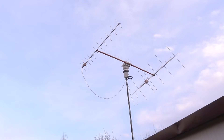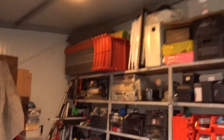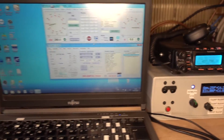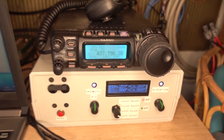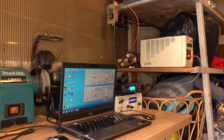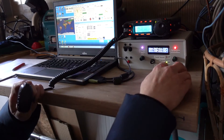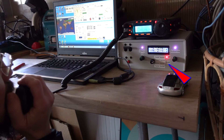This is my setup for working on satellites. It consists of two antennas — one for VHF, one for UHF — the antenna rotator, the antenna switch, an Arduino controller for the antenna, a computer with software to point the antenna and adjust the frequencies, the CAT cable, and of course an all-mode all-bands transceiver. It's complicated but necessary, because the satellite pass is so short — you have a lot of work to do in very little time. This kind of automation lets you focus on making contacts without worrying about adjusting the Doppler frequency, pointing the antenna, or manually switching the transmission and reception antennas.